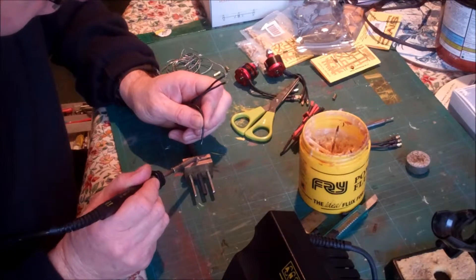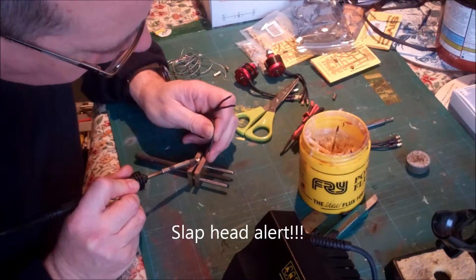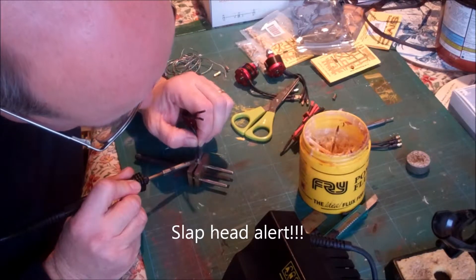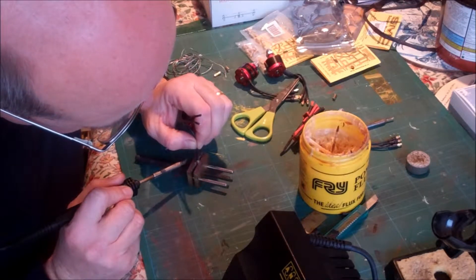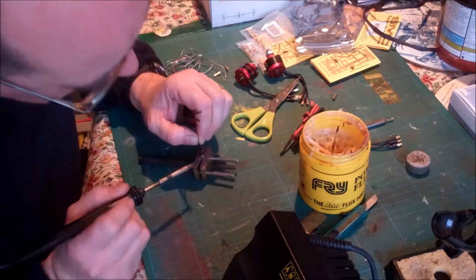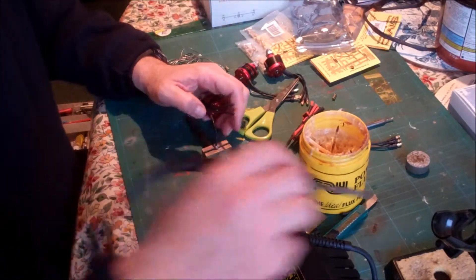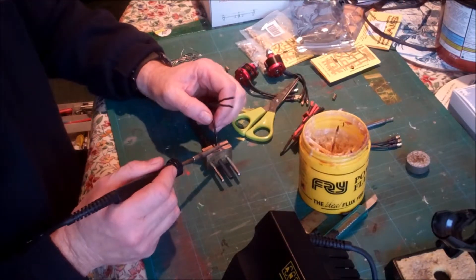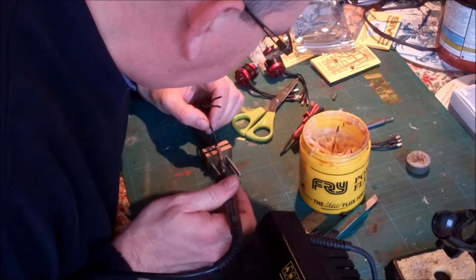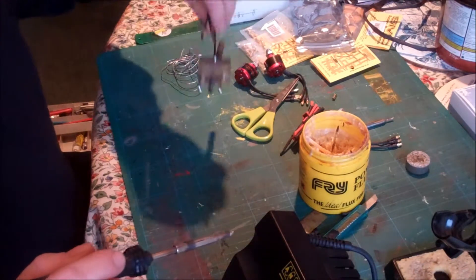Just touch that — I know I'm doing it on the wrong side, I'll see if I can get it to the side you can see. Pretty obviously when it goes liquid, just plonk the wire in, let it go. And as you can see, that's taken really well. Some solder came out of the side; I'm going to try and get rid of that, or spread it around at least — wipe it with the iron. Looks a lot better. Still well attached.